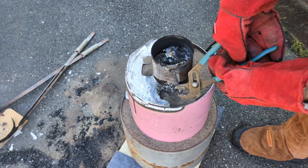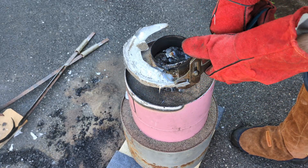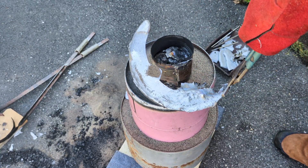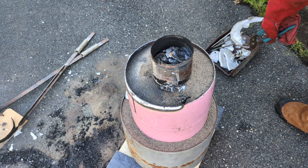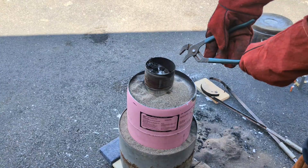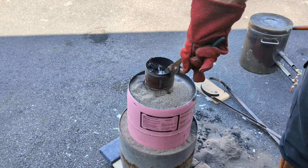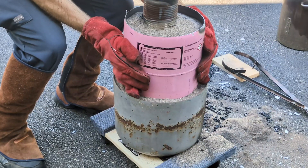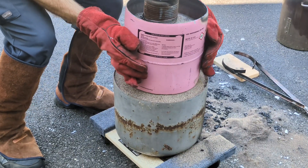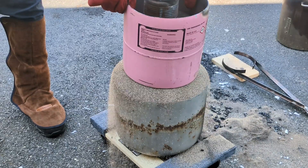I gave it about 25 minutes before I started to remove some of the hardened aluminum on top of the mold. I figured it would be a lot easier to disassemble the mold without this hard aluminum — it's basically connected to the steel I had there. I normally just pull out the cast using a pair of channel locks, but this one gave me a lot of resistance, which kind of gave me hope. So I decided to pull up on the drum and have it expose the cast to see how it came out.